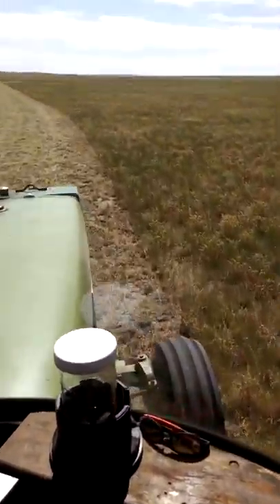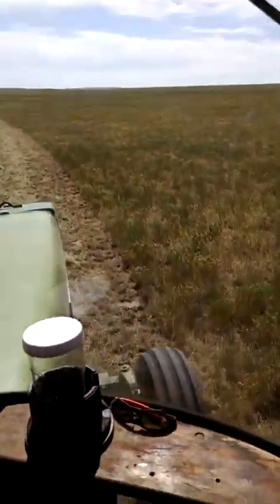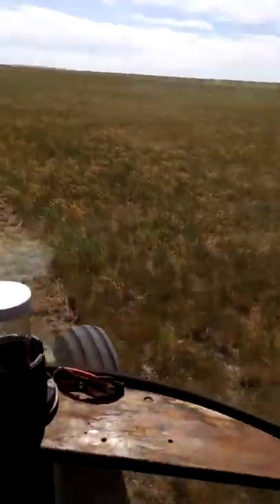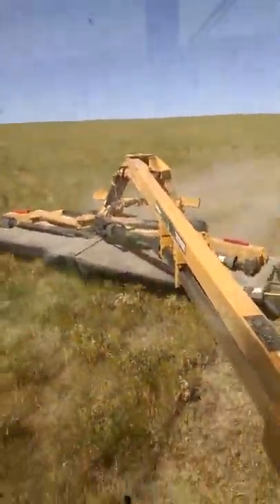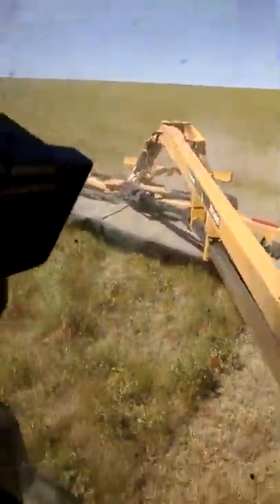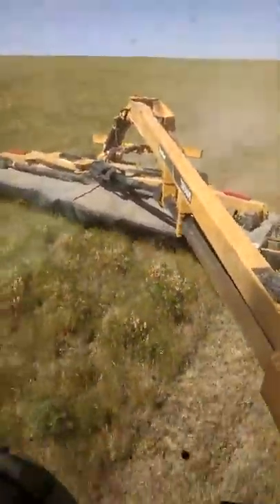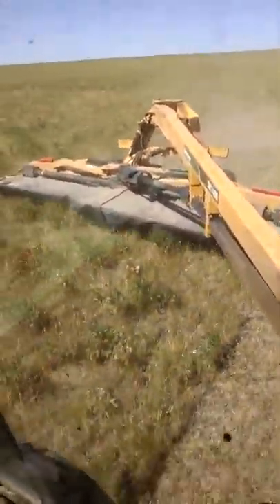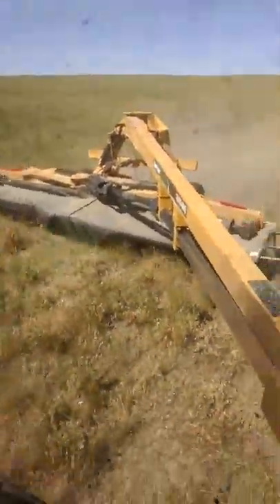This tractor is using about four to five gallons an hour. Kind of a thirsty old tractor, but it's real reliable and cheap to own. This cuts an 18 foot swath and will fold up for transport down the highway about eight feet wide. Right now I'm running six and a half miles an hour. I probably won't cut more than 80 acres today, but on a smooth field where I can run nine to twelve miles an hour, I'll cut well over 100 in a day, no problem.